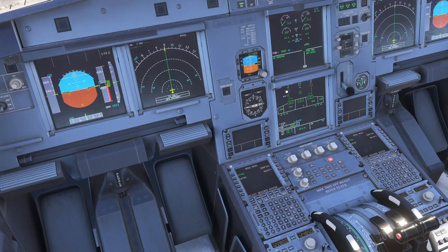Coming to the fuel page now, you'll see that the fuel valve has been force-closed by pressing the engine fire push button. In both of those scenarios — whether the fuel valve closes on its own or we've used the engine fire push button — we can expect a time delay of up to two and a half minutes before the engine shuts down. That delay is caused by the engine burning off the remaining fuel between the low pressure valve and the fuel nozzles.